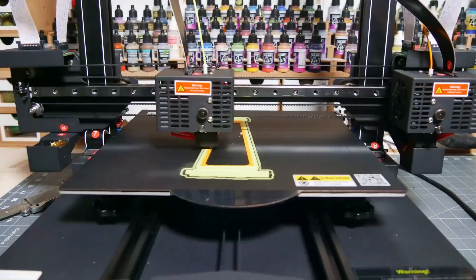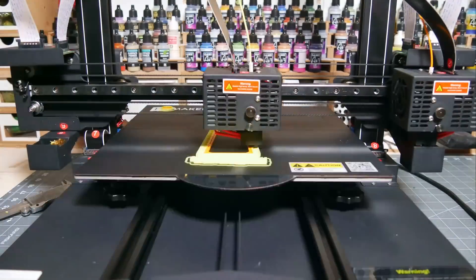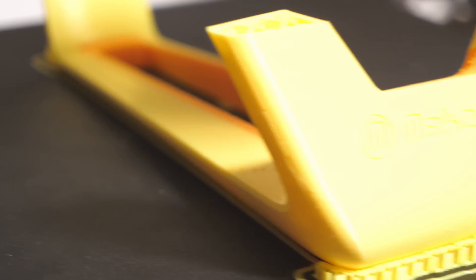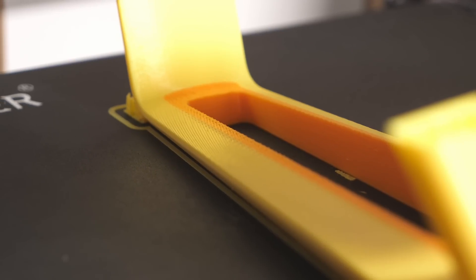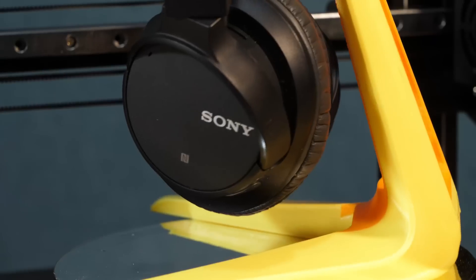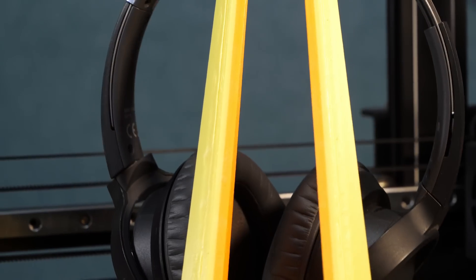The printer does have purge buckets, meaning you can adjust it to have just a little purge before the tool switch, but since I didn't have enough time to calibrate the purge process I opted to use a wipe tower in IdeaMaker. The first print was a dual color headphone stand for a friend of mine, done in the PLA that came with the printer — orange and yellow. Unfortunately the design isn't the most 3D printer-friendly due to the rounded edges, but the print came together quite nicely, especially considering it was the very first print on this printer, sliced with a brand new profile created in IdeaMaker without any prior filament tuning.